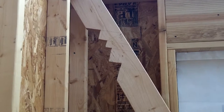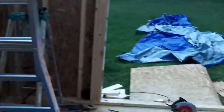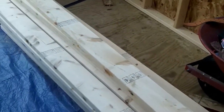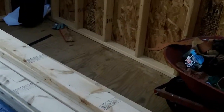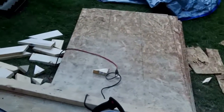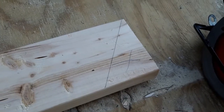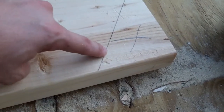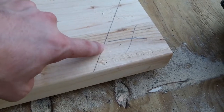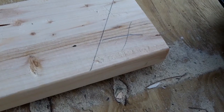I started doubting myself — maybe it's not the right angle, and so on. Eventually I came up with a master that actually worked, and that's what all these are based off of. You'll see the cuts here: there's the cut for the ridge, and that's at the angle that you want. From this angle right here, this is your angle of your roof. For mine, it was 37 degrees — it's close to a 10-and-12 pitch, but not quite, probably somewhere in between.